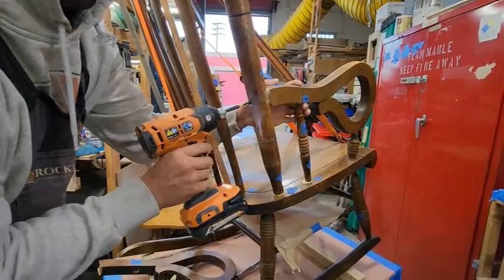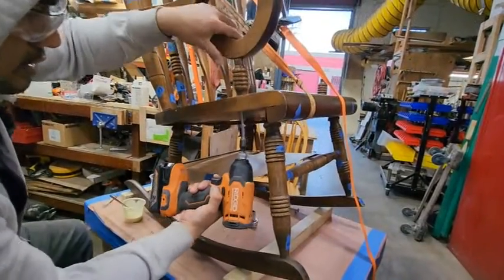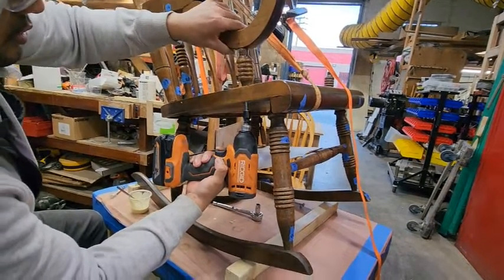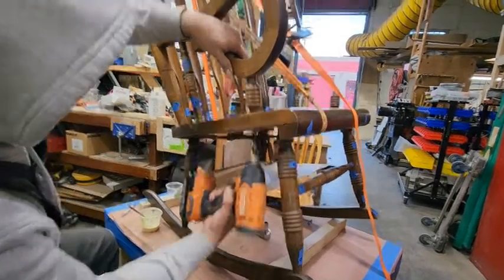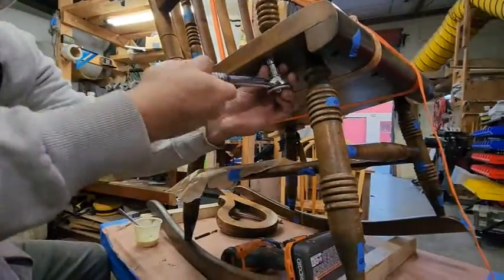We're putting our armrest right back here, shooting our screw in. We have our spindle in place. Now we're just going to use the impact driver, and we're just going to start that lag bolt up into the bottom of the armrest, but we're not going to shoot it all the way home with the impact driver because we don't want to strip it or go too strong. We're going to just use our ratchet. Manny's right here with the ratchet in his hand.